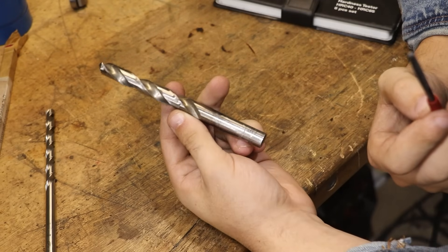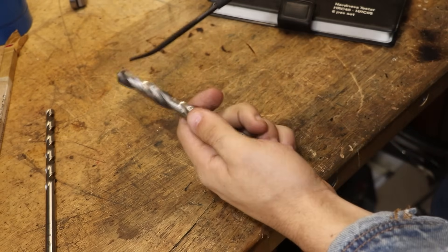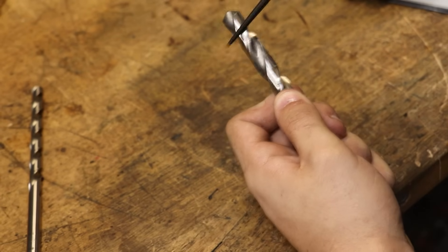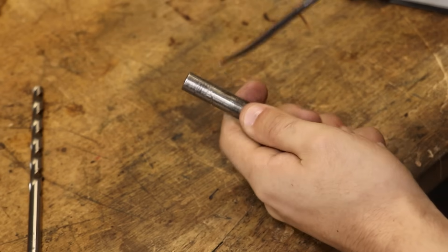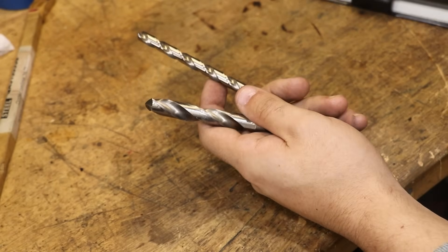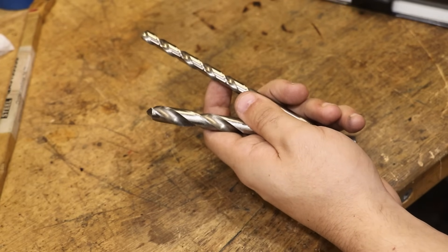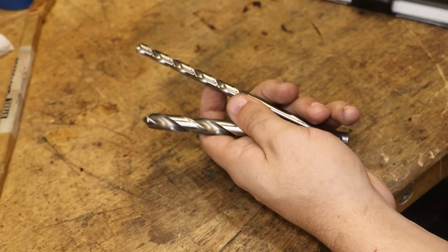What I also have here is a very cheap Chinese high-speed steel drill bit. The quality of the steel is definitely not as good — it's not M2 high-speed steel — but if you look at it purely from a hardness perspective, the cutting end is also 65-plus Rockwell C, and the chucking end is less than 40. So from a hardness perspective they are pretty much exactly the same. But having used both, the Sutton's is a better drill bit — it has much better hole-working properties and lasts longer. The hardnesses would not tell us that. Hardness is not always a good indicator of material quality.